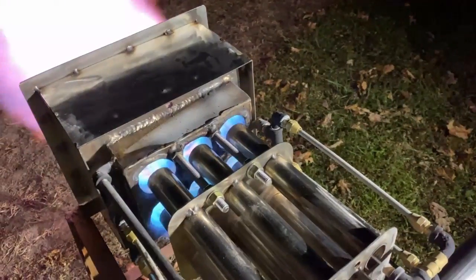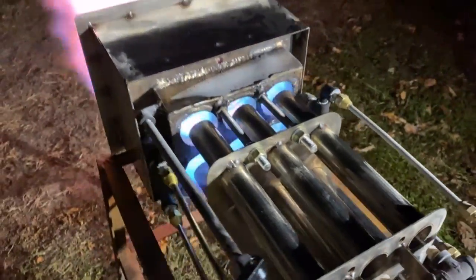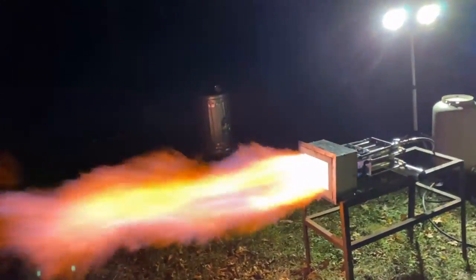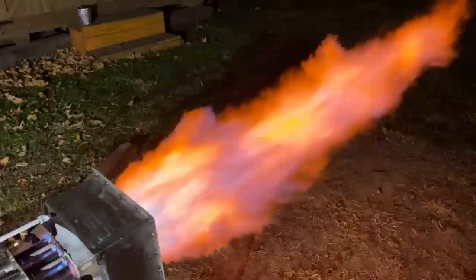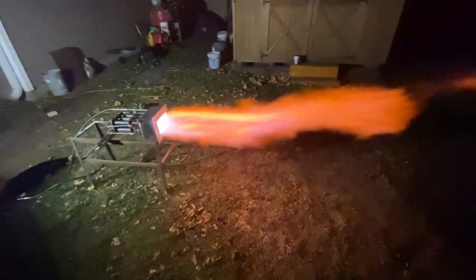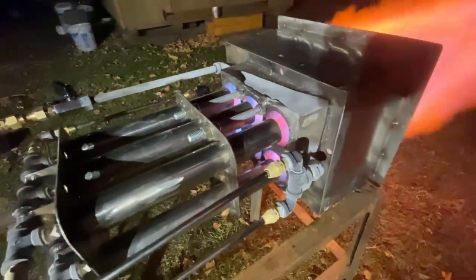The performance is phenomenal. I do want to make some changes to it, and that's what we're observing here — to determine exactly what those changes are going to be. So let's go for a little walk. One of the first changes I noticed is the propane line connectors. The stainless steel lines need to have a loop in them. See how it's just a straight pipe? Look how cold that thing is getting. Those straight pipes need a loop so they can be easily attached and I don't have to worry about expansion and contraction. I think putting a loop in each one of those pipes would make assembly a lot easier too, because they fit very tight.